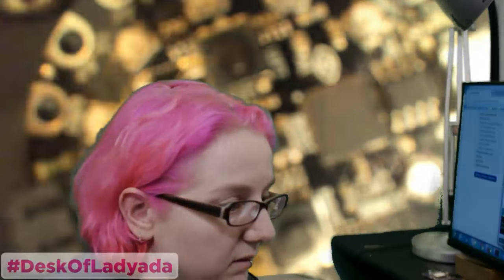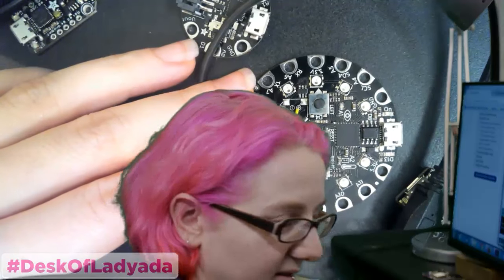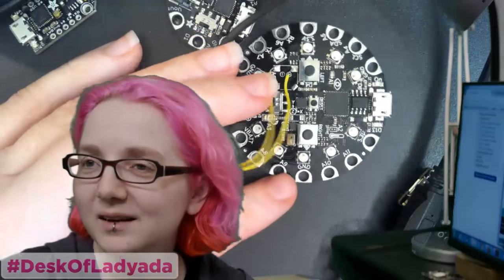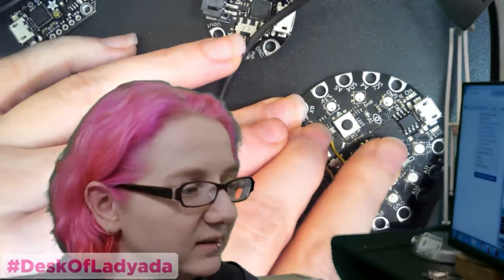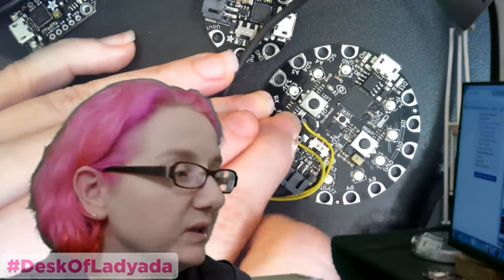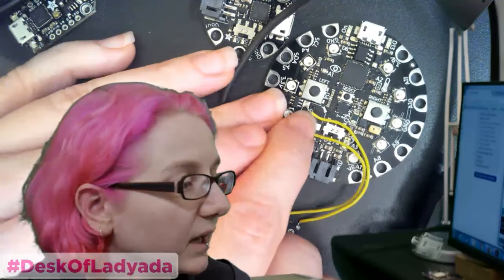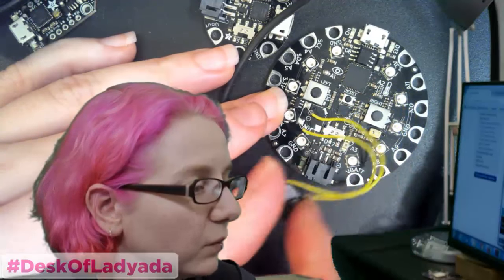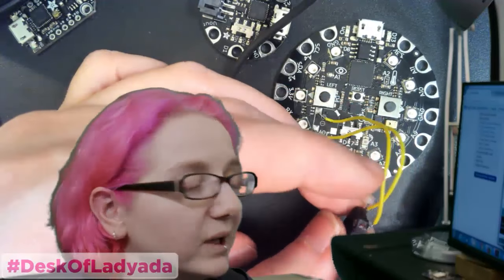There's a request — Portal 2's 'I Want You Gone,' the song at the end? We could do that when we launch — it'll go viral and be a meme on the internet. You could actually have all of her speaking samples — you can get wave packs, and it can just speak them. So this has a little Class D amplifier now. It was a little bit more expensive — like 15 cents per. It's the PAM 8301 Class D. The speaker is a little bit too big so I didn't solder it in place — I just wired it up. You're not going to get really good quality audio out of this. You can get okay quality audio or loud audio, but not both.